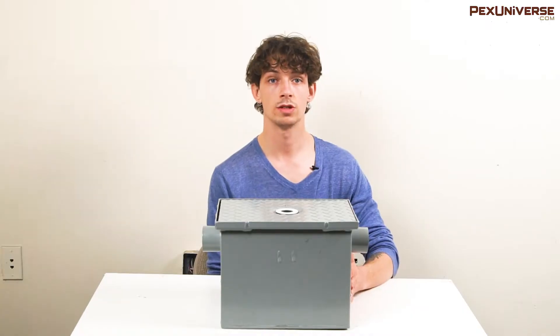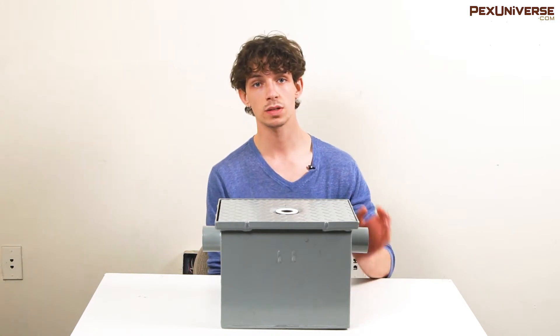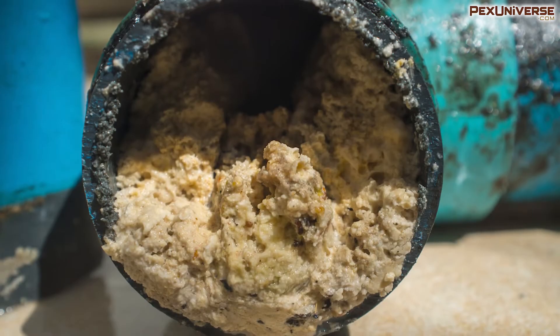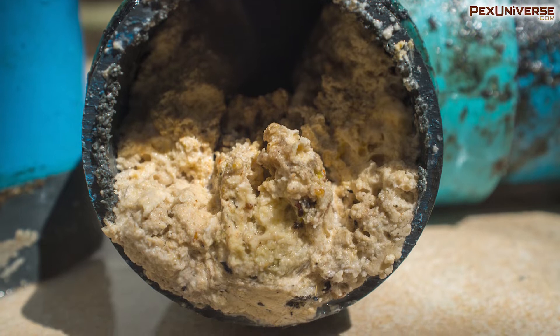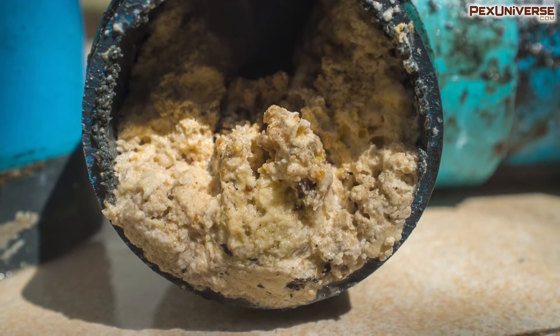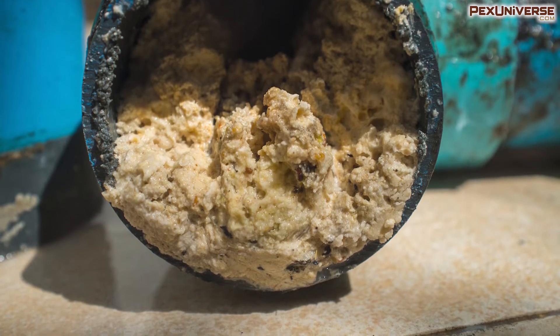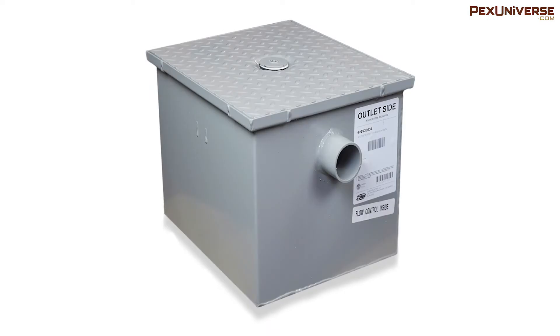It is often required that a grease trap be installed anywhere where food preparation is taking place. You'll most likely see these in a restaurant or the kitchen of a cafe or bar. Slowly but surely the grease will build up on itself and grow, forming into a solid and blocking out the entire pipe. In the context of working in a commercial atmosphere, such as a kitchen that cooks a handful of meals a day, you might want an on-site grease trap. What is it and how does it work?